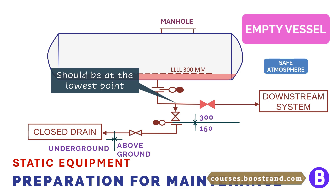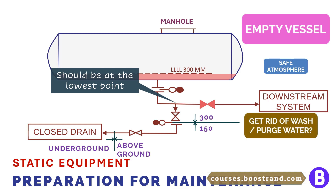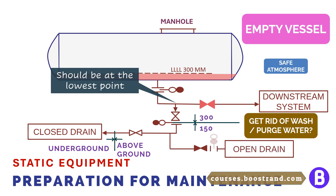After the system is evacuated, we shall carry out steam purging activities to prepare the vessel to be open to atmosphere. Then, after evacuating the vessel, we shall carry out wash activities inside the vessel. This results in water accumulating in the system that we need to get rid of before getting the system back into operation. So we need another system to deal with this water, which is considered oily water. In this case, we have a connection to a segregated system — the open drain system — which is expected to handle water with residual hydrocarbons under atmospheric pressure. It is usually a concrete sump underground to ensure gravity flow of the drained fluid. So to drain the oily water, we can open the valve, change the spectacle blind position, and send the wash water into the open drain system.